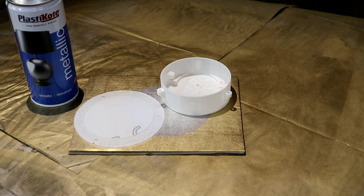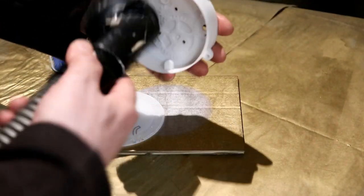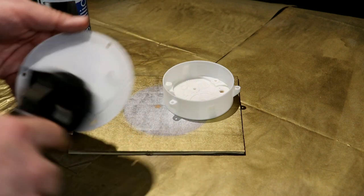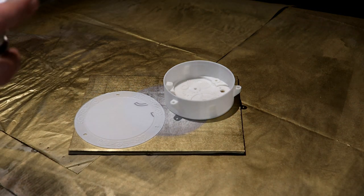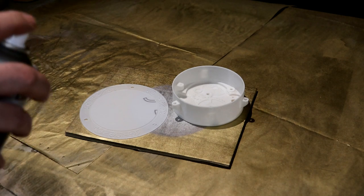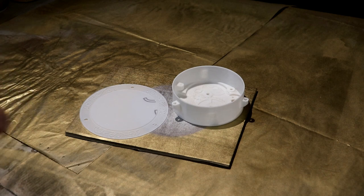Also what I always do is to hoover them before I paint them to get all the dust off. If you have some sort of hoover brush, just hoover the inside because dust sticks to plastic and you don't notice it until you've spray painted it. I recommend spray painting at a distance of about 25 centimetres, about a foot roughly. And don't put it on too thick — even though it's very tempting to spray loads on, do far lighter coats. It's much better; they dry more quickly and give a much better finish.